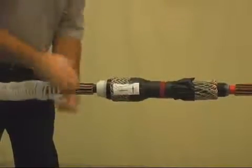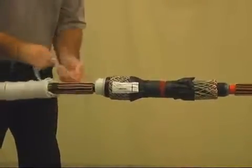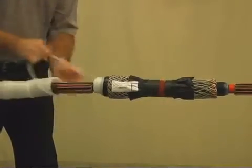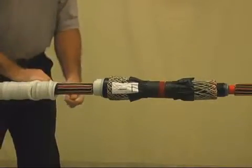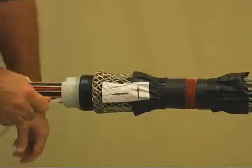Important hint: the splice body must remain aligned with the marking tape while the spiral holdout is released. Once the splice is partially shrunk adjacent to the marking tape, there is no need to hold the splice. Use two hands at this point to remove the remaining holdout.